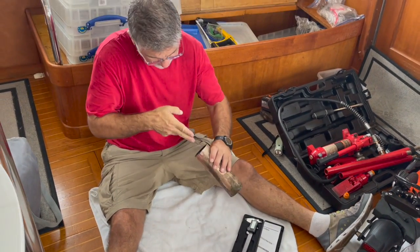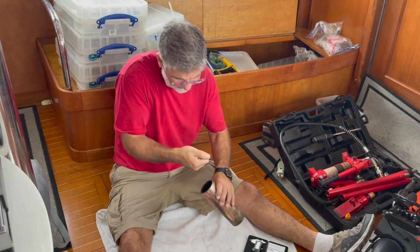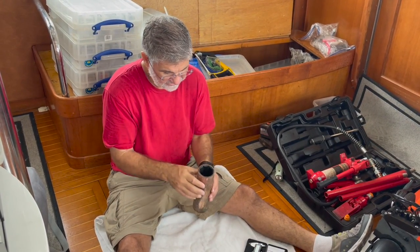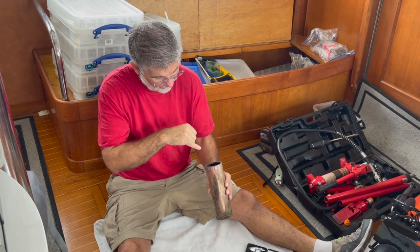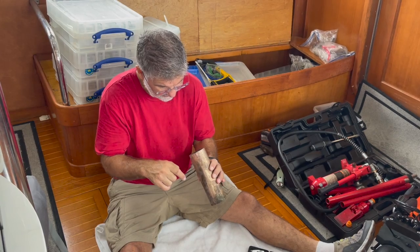One of the things that's really interesting about this is normally when this is done, people use a hacksaw or a Sawzall. They cut through this material and then they bend it inside, which destroys the Cutless bearing completely, and they just throw it aside. Because I was able to get this out in one piece, I can actually see the wear pattern pretty distinctively on both surfaces.